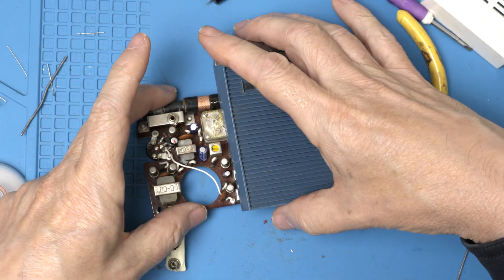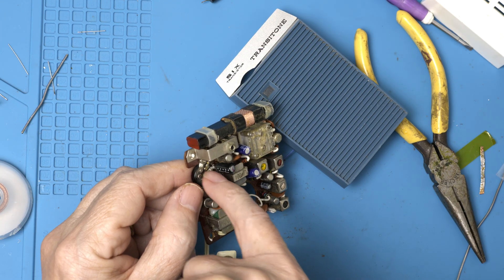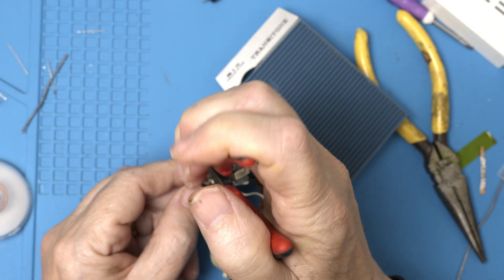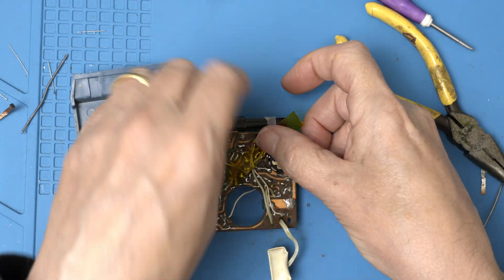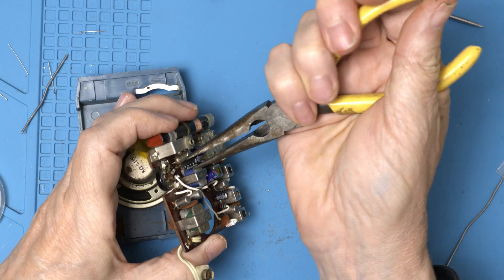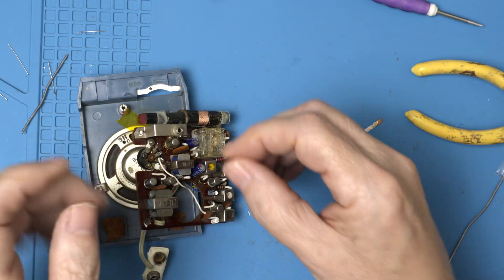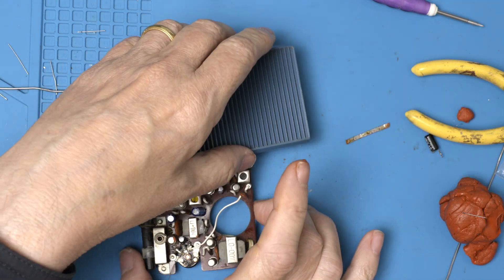Three are in, just one more. This one's interesting — one lead is connected directly to the potentiometer, so I think it's easier just to cut him out. The other lead is soldered nearby, so let's cut him out. Let's protect this area a little bit. I've got him out and he is 5 microfarads. It looks like plus is touching the potentiometer — I think it'll be easier if we go in from this side.